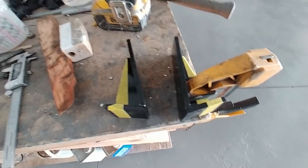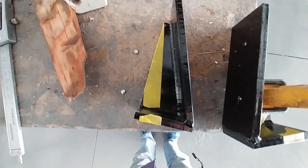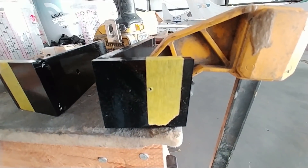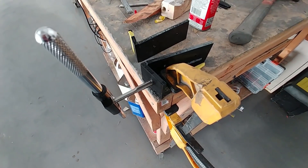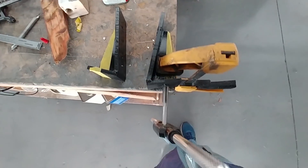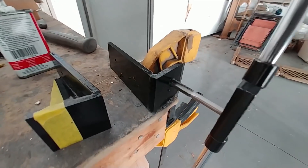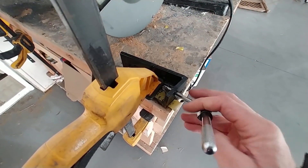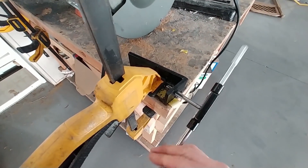The edge of that yellow tape indicates the line where I need to drill the hole, and obviously tap it — that's why I've clamped it to my table. I've already done a center punch where the hole is going to be, drilled it lined up with the edge of the tape, and now I'm tapping the hole. It is on a bit of an angle, but it's quarter-inch 4130 so no big deal. Here's the other one — finishing that off, so both brackets are done.